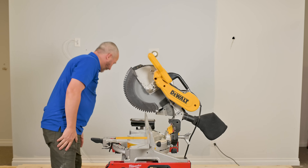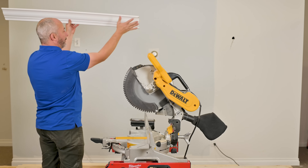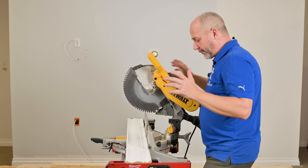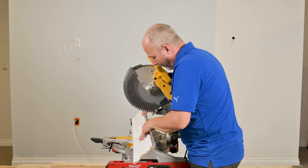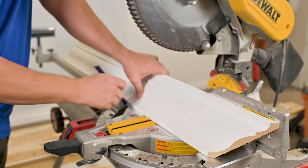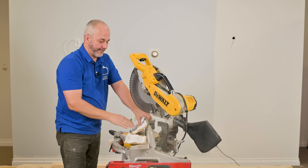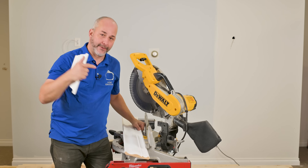Speaking of crown, when you're using a chop saw to cut crown molding, don't visualize it like it sits on the wall and try to measure it that way. You turn it upside down. When you're visualizing your crown molding, this is your wall and this is your ceiling — everything's backwards and upside down, but it works great. You set it on the fence so the measurement from here to the top is consistent, make a pencil line on your table, slide it over, set it to 45 degrees, and do your miter cut. There's more detail in the crown molding video linked in the description.